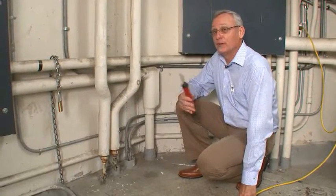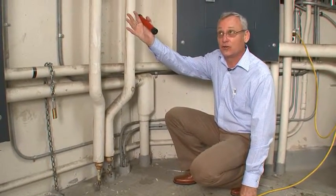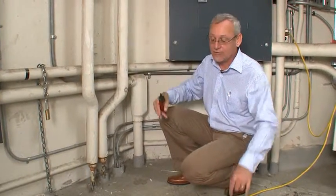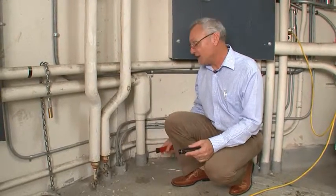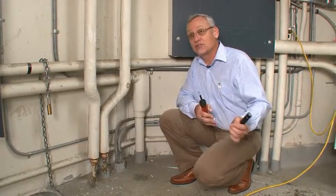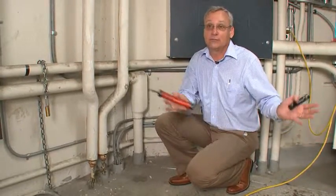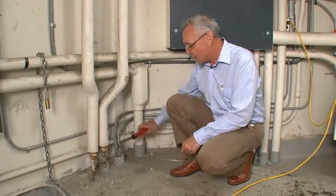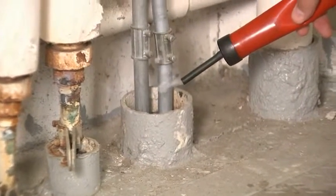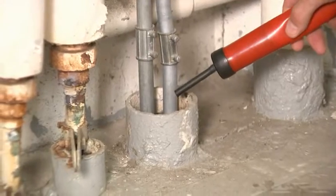We're in a mechanical room and we've determined we want to compartmentalize this from the rest of the building. Outside, you have an open vent on the side of the wall pulling in air for the combustion appliances up here for heating and cooling. So we want to seal any chaseway or doorway we came through — making sure conditioned air isn't transferring up or outside air isn't coming in from outside into where we're heating or cooling. Here is a chaseway with two conduits, and you can see stack pressures going — the smoke is going up, pulling conditioned air from down below into this room, which we don't want.